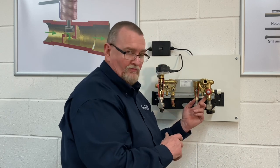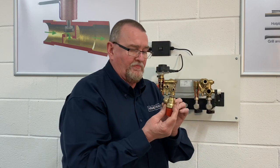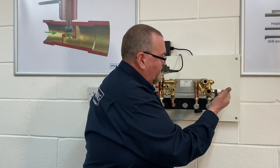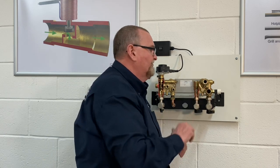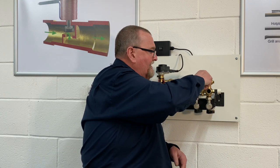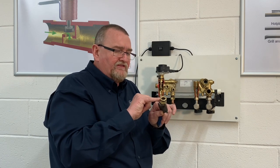The PRV sits in there held by a 2.5mm Allen screw underneath. Use a ball-end Allen key so you can come in at a slight angle to unscrew it — then pop it out. These PRVs typically drip when there's no pressure in the expansion vessel. The drain cock has been part of Baxi manifolds and hydro blocks for a long time and is available as a spare. The spigot has evolved — this one has two washers; some have three. Use an adjustable spanner to gently lever and turn the spigot to remove it without damage — avoid using grips as they'll create grooves in the brass and cause leaks.